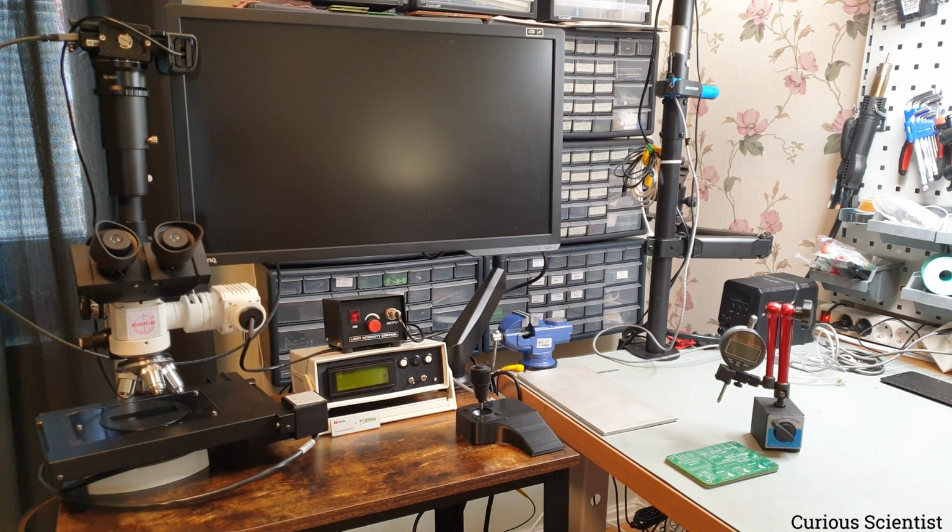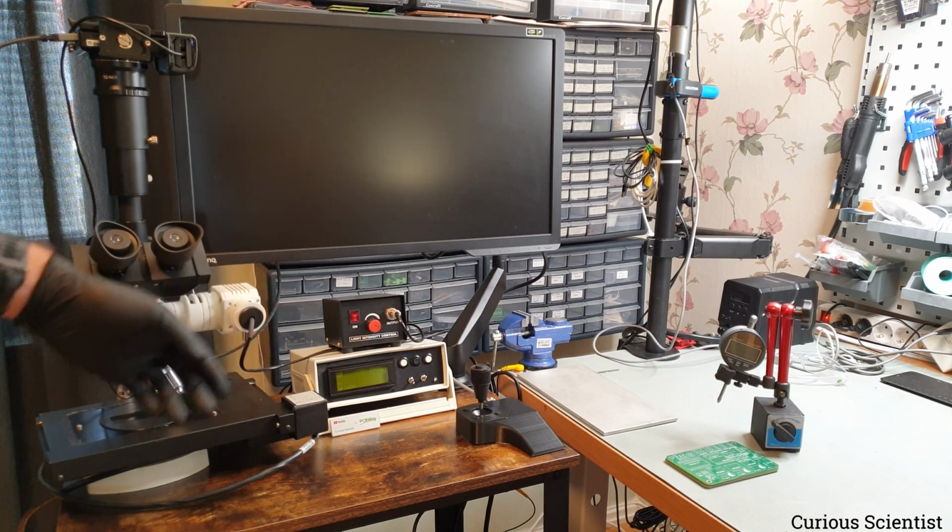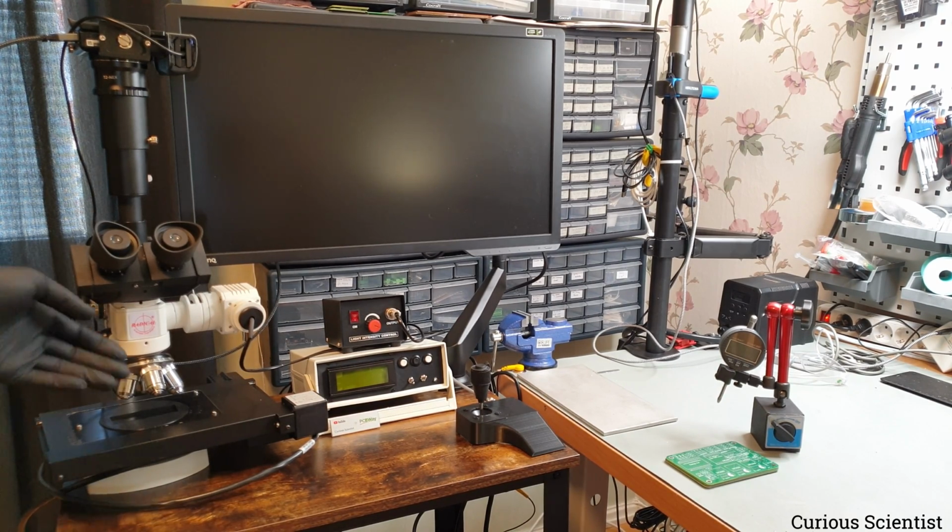It has a display which can be used to display all the relevant information regarding the position of the stage, the condition of the stage, whether we are homing, moving, or the system is in a standby status, and so on. It has 3 buttons, a moving forward and moving backward button, plus an abort or stop button. It has 2 switches because you can select between the modes, like joystick mode, button mode, and you can even control this thing via USB, so you can select that. And then when you are in button mode, since we only have 2 buttons, you have to pick an axis, so you can control 1 axis at a time. With the help of the selector switch, we can say that we try to move the X, Y, or Z axis, and then the buttons just move the selected axis.